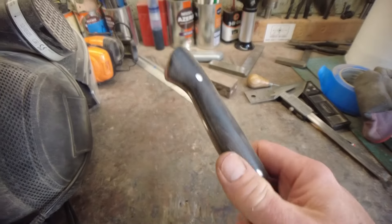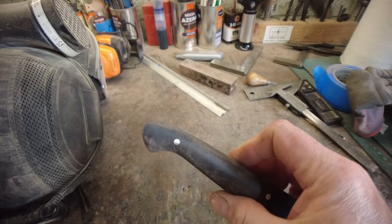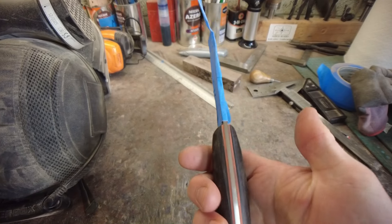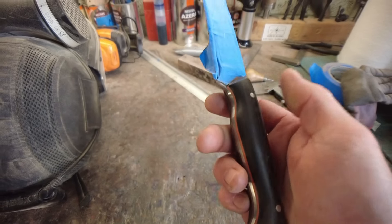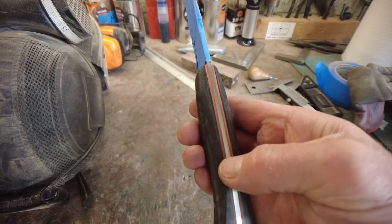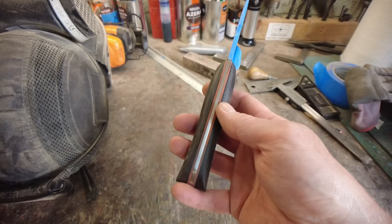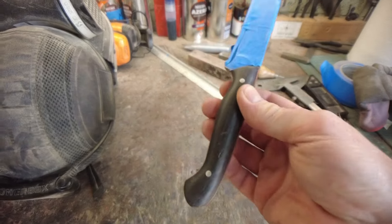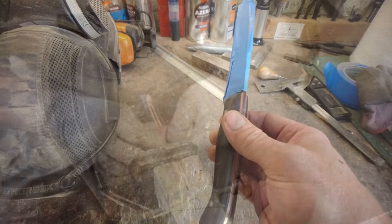The next job for this morning is this knife — the ebony one. It still needs the last bit of sanding. It's actually quite smooth, it's a lovely handle — solid wood to work with. I just need to do 320 grit around the edges to get rid of any dirty marks, then 600 all over, 800, then 1200, and then it's ready for a polish up. But before I do, I've got to make a kydex sheath for it, so I'll crack on first with the sanding.